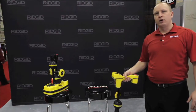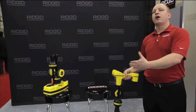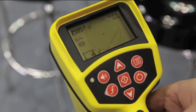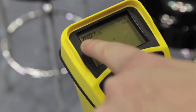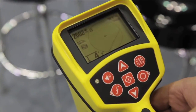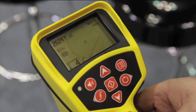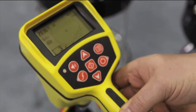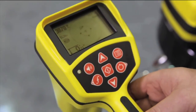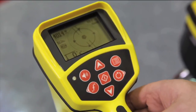Once I'm set to 512, I'm going to use the proximity signal. The higher the number, the closer I am to my target. We have a real-time depth reading in the lower left corner and our proximity number in the upper left corner. The higher the number, the closer we are getting to our source. As we move closer to the camera head and that number increases, we're going to notice the pole. When we zero in on the pole, we get the direction.